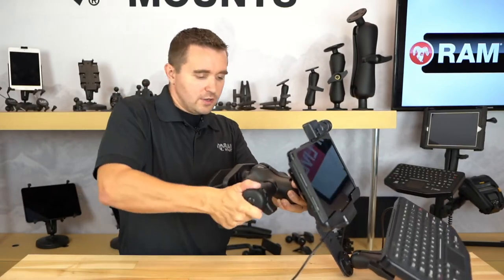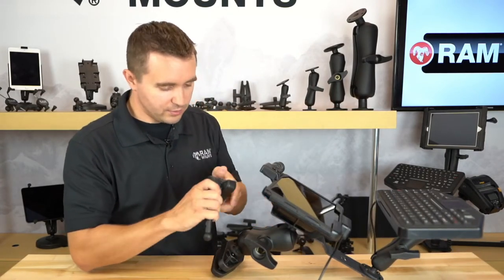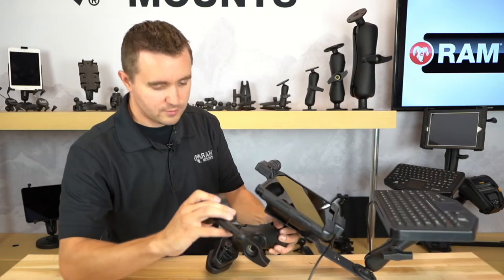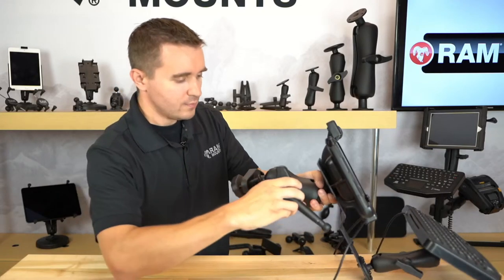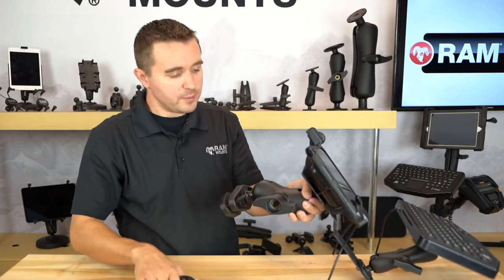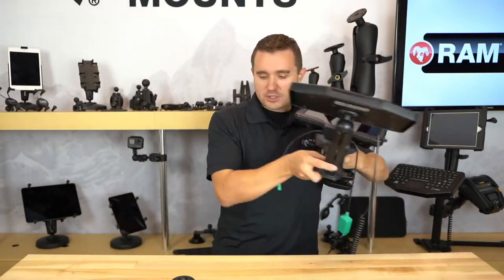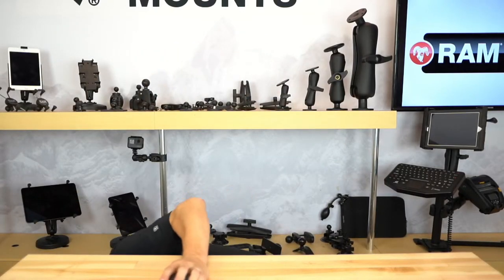Because of all that weight and pressure, it's good to use D-size components and have the extra peace of mind from the high torque wrench accessory. You get the mount in the position you want, tighten down by hand, then take the high torque wrench and tighten it a little further — pressing down to tighten to a point where you could not loosen it by hand. Again, this theft deterrence aspect may be just as handy on a forklift as on a boat.